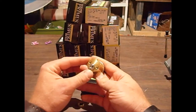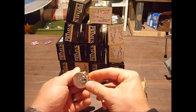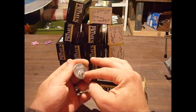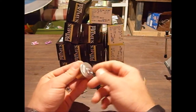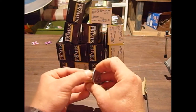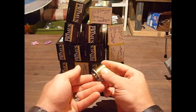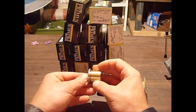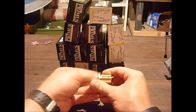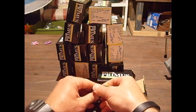I already did that to speed things up on the video. Essentially you just take the back ring off - or if there's a tailpiece, take that off. There's a little spring in there, and now you've got this Primus. To get it apart, like I said, I've already worked on this a little bit. Normally you'll have to take a rake or something like that, rake the pins a bunch of times, maybe lube it, and then tap it on the table. Then you just push out the plug from the front - you'll see it start coming out, and all the pins are at the shear line. You're just pulling out the plug, and all the finger pins are popping out the bottom.